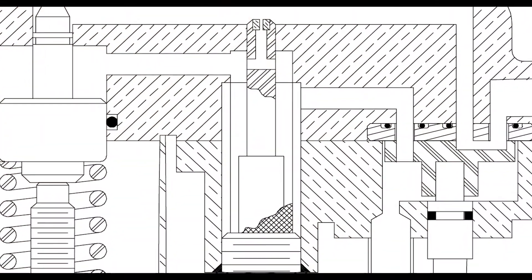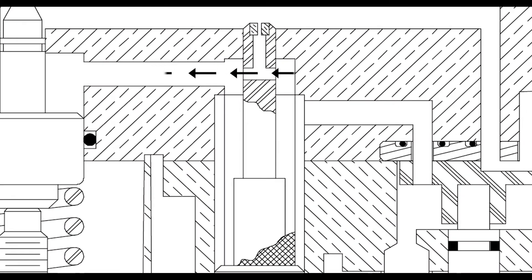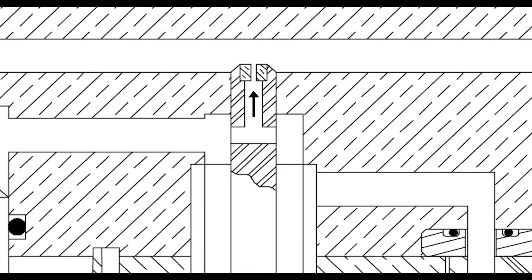The cross hole allows water to flow through the tip of the stem. The small orifice in the tip of the strainer is how water gets to the back side of the relief valve when the valve is in the on position.